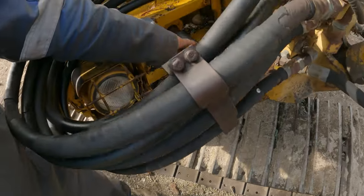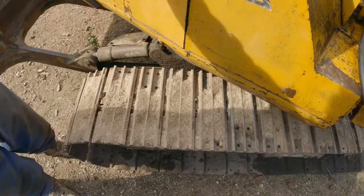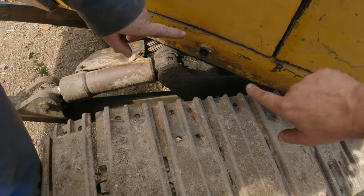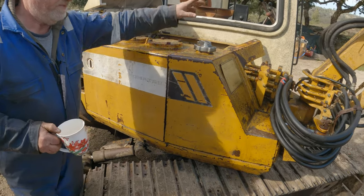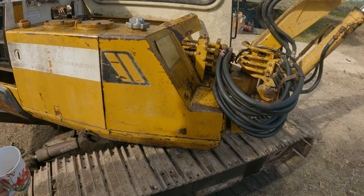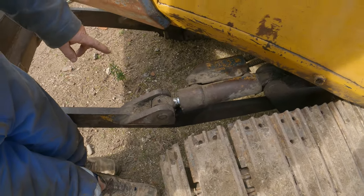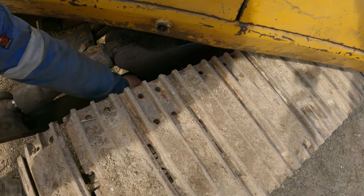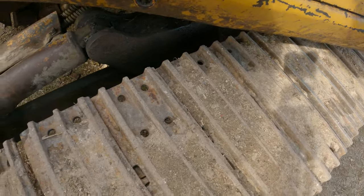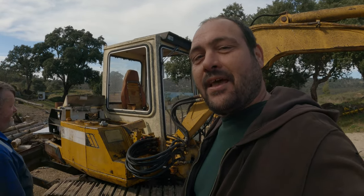That's twelve nipples so far. This machine has an offset dig — that's this cylinder here. One pivot at one end, another at the other end of the ram — which is actually well concealed but has good access once you find it. The point is on an old machine you might need to look for it; it could be reaching down in there. Each cylinder has to have one at either end — there has to be a grease system. Thirteen, fourteen. The blade has two rams, so that's plus two on the rams, plus one where it hinges to the chassis — that brings us to twenty.